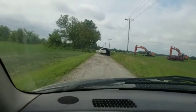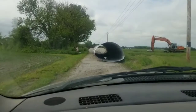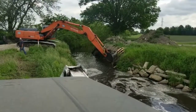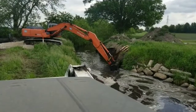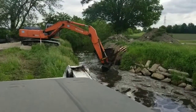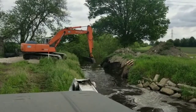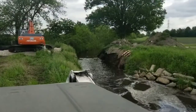Today's project: get this pipe put in that ditch and out of our hair. We've got the 270, the 330 sitting here, and our T300 Bobcat on a trailer. My uncle Jamie is reshaping where the culvert's going to sit with his 330 Hitachi, because the 270 won't reach that far. He's getting out some chunks of concrete that are in the way and making a nice bed for this pipe. First we've got to put number nine limestone in the bottom for the pipe to bed on, then we're going to backfill the pipe most of the way with the number nine limestone.